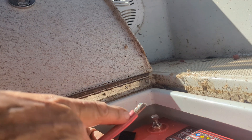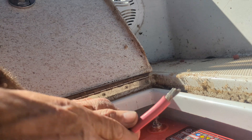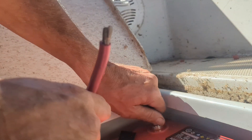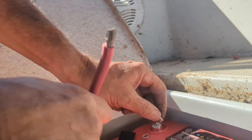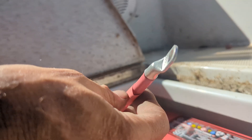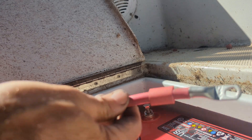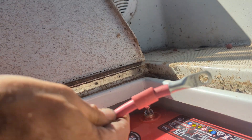Crunching sounds would indicate that corrosion is crawling through the wire. Once you've selected a lug, it's important to grab the bolt it's going to pass through and make sure it's going to work with that particular lug before you crimp.